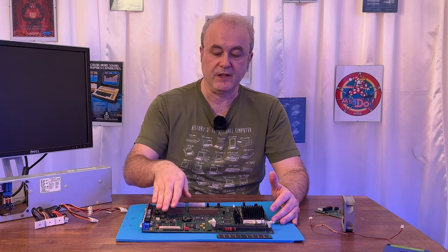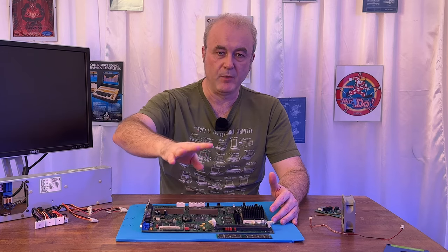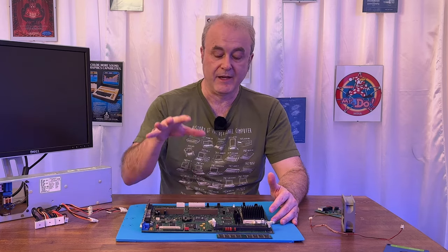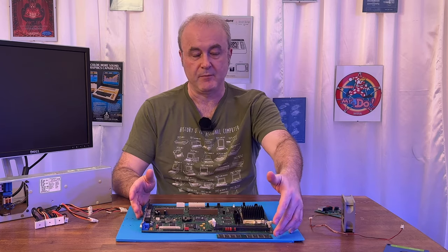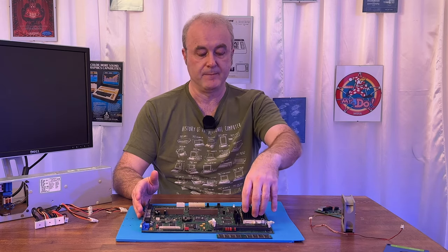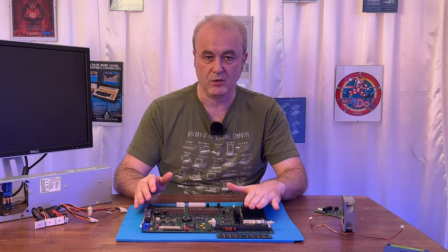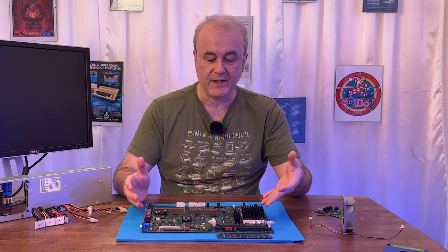And then what I do is I chase those sort of like strings of water until I blow them off the edge of the logic board. Go all the way around the entire logic board until eventually you don't see any more streams of water coming from anywhere, and you can tell that the board's actually completely dry. Obviously, when I do this, the memory would be unplugged, the CPU would actually be taken off the board, you know, the heatsink would be removed, and the CPU would be put to one side. The CPU itself doesn't need to be washed or the heatsink, so that's all put to one side to make sure that you haven't got any sort of places where water can get trapped.